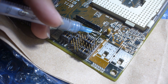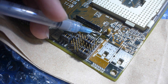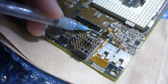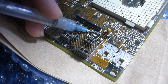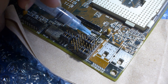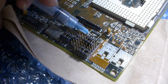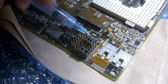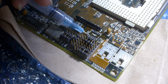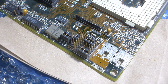Leave a blob there. Another blob there. The trouble is that the lead paste got stuck in the needle shaft, but trimming it fixed that. It doesn't matter if the blobs of lead are quite close, because this lead paste, once it melts, will clump into place into the pad essentially.